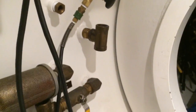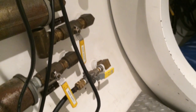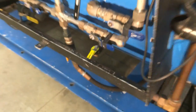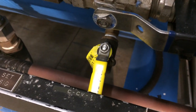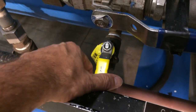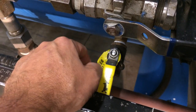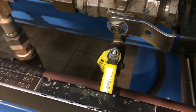Testing the mask works just fine — there's your overboard dump and supply line for the oxygen system in the outer lock. On the outside, the external overboard dump for the outer lock is located right here. This valve must also be open when breathing oxygen. Whenever doing an oxygen run, it's very important that the masks are tested and all valves are set in the correct position.